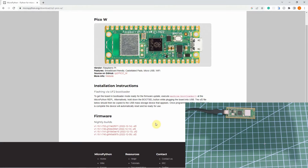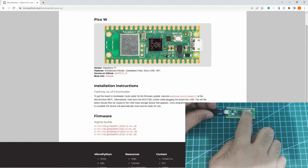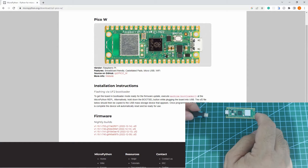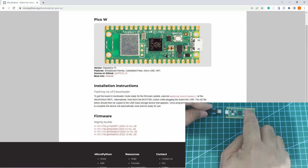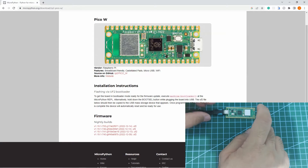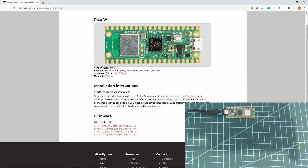As you can see, the folder automatically closes. Let's just wait for a couple of seconds. We will just need to power cycle our Raspberry Pi Pico W device. Let's do a power cycle and then plug the USB cable again. Now we're going to test our installation of our MicroPython firmware.